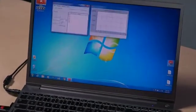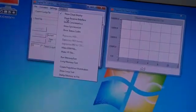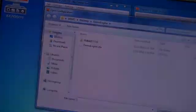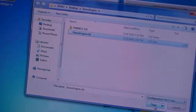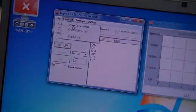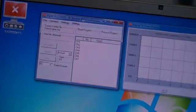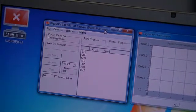Open the DigFV software. Under the Utilities menu, select Show Receiver Interface. Under the File menu, select Open Configuration. Select the CFA file found on your project CD. On the Connect menu, select Open Connection. This connects the software to the receiver. You will see a status bar indicating the connection was made successfully.